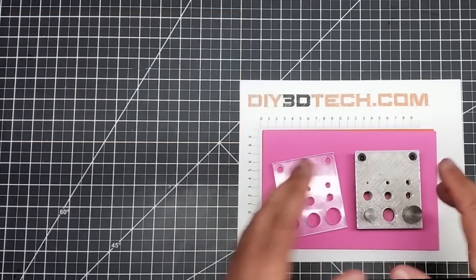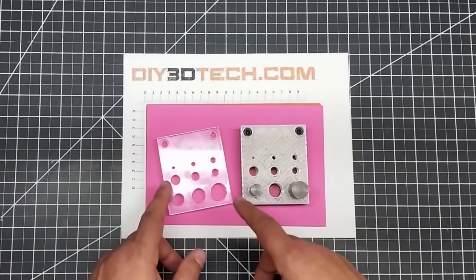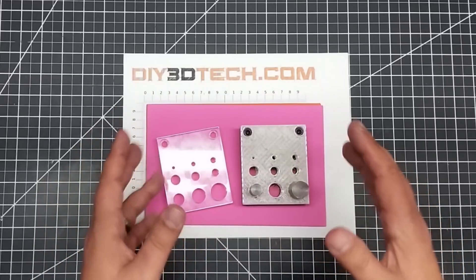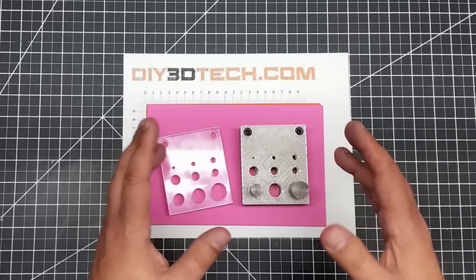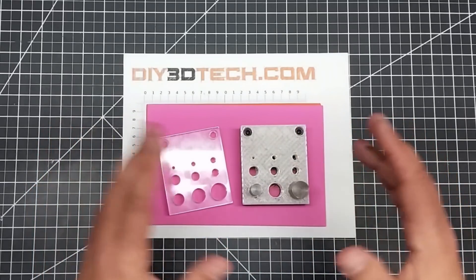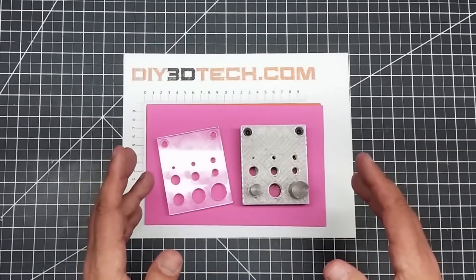This tight one is very, very tight. So I'm going to do another one where I open it up about 0.1 or 0.2 millimeters on each one of the holes, because usually I find I go about 0.2 millimeters — that's about what I experience in contraction in the plastic, especially for PETG. So if the tight one happens to be too tight, you can go with the loose one.